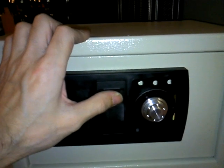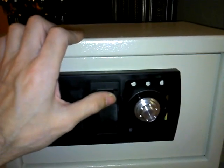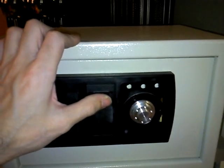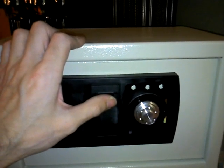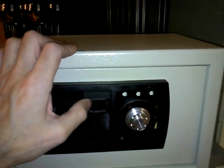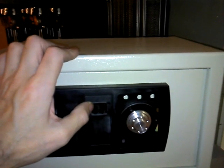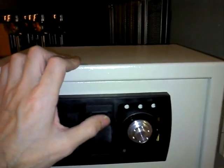So this is running off an Arduino Nano. I had it running off of 4 AAs, but the solenoid was sucking down the voltage regulator, causing a reset. So I had to add some protection circuitry, and I went to a 9-volt, which was okay because the 9-volt fit right into the battery bay, no problem. So this turns it on.